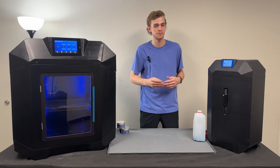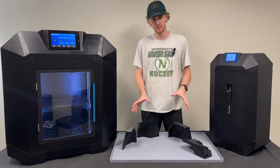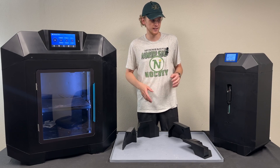Flow is a bit smaller, so I'm going to show you how we use resin injection to make the front cover. Normally you can just take the 3D prints off the bed and start injecting, but since we want to get the part as smooth as possible, we're going to sand it down, assemble it, and then inject using Flow.